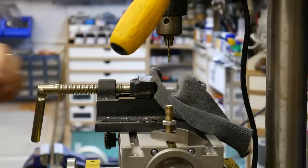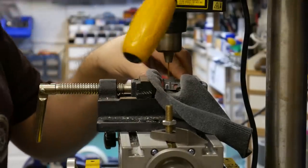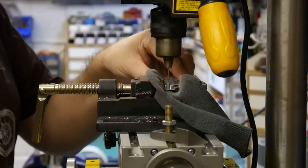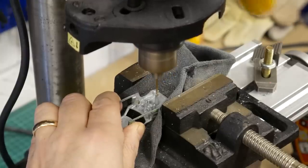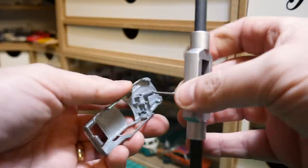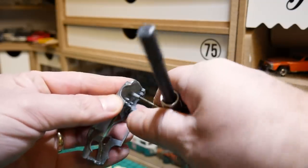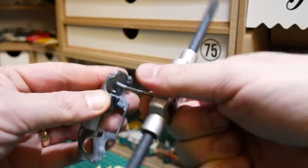At this stage I'll go back and drill all the way down the post that was holding the chassis and body together, because I'll be using a screw to hold it all together. When you come to tap it, go slow and precise — it's not good when these snap and it does happen. I use a little bit of oil to ease it along, but the minute you feel it start to bite too hard, back off because it'll start to snap. Just take your time.